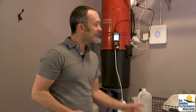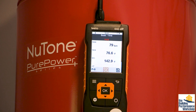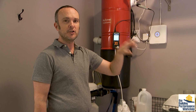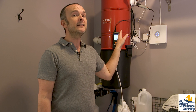It's only pulling about 50 to 60 CFM, which is not a lot of air — about the same as a bath fan. The temperature coming out of this is 142 degrees Fahrenheit, which is pretty hot. In this small laundry room with doors closing it in, when we run the vacuum we'll want to make sure we open the doors, otherwise the room is going to start overheating. I do have an exhaust stack in the wall that I could open up to exhaust air outdoors — perhaps up high so the warm air, which rises, gets pulled out at the top of the room. But with only 50 CFM being pumped in, exhausting the full amount is not a long-term fix — that's just a band-aid over part of the problem.